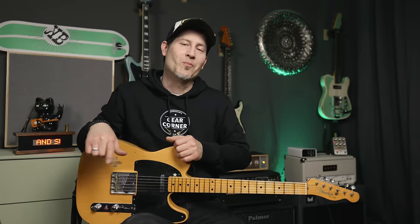So what did we learn from that? I do not know. This formula still works. If you keep the gain lower than 3 o'clock, clipping diodes are hard to tell apart. If you crank the gain, there are differences. And for whichever reason, even though I never ever played an original Klon Centaur, I gravitated towards those germanium diodes, which is funny.